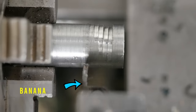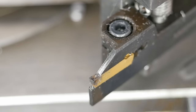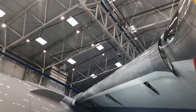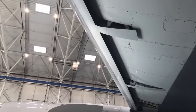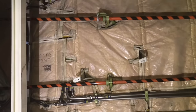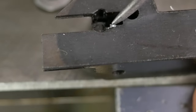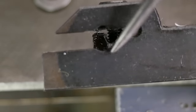Same feeds and speeds as before, same material. But it didn't work. It looks like it smashed the tip off that insert — yep, that's a pretty unhappy looking insert. Hey, speaking of crashing things, if you want to keep your plane upright you've got to make sure the high lift devices come out symmetrically on both sides. If you've been wondering how they ensure that symmetry — it's just torque tubes, running through the bottom of the fuselage from left to right for both the slats and the flaps. Okay, that tool holder's toast. The insert got pushed back and this little backstop feature has been munched. Change of plan.